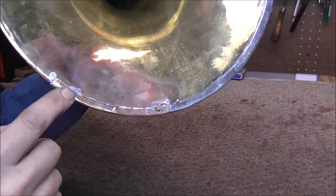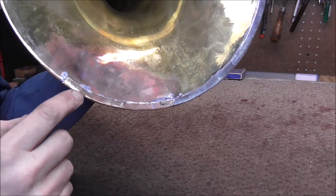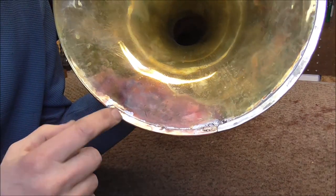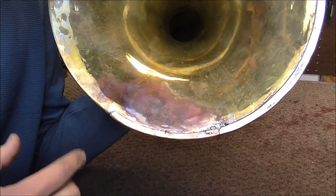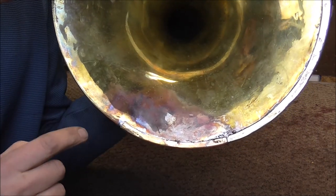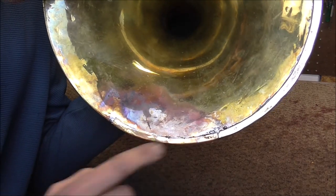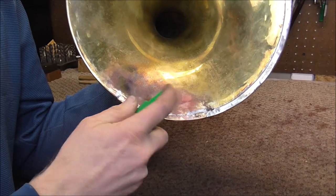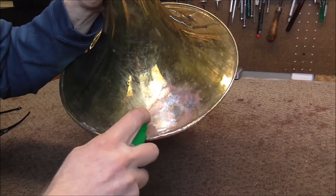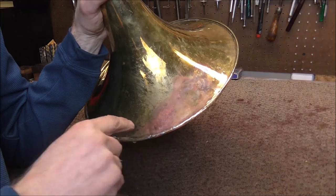There's a big clump there. The way I do that is I'm going to heat it up until I see it melt, and as soon as I see it melt I'm going to take the flame off and wipe it with a rag to clean it up. Then it's going to have an extremely thin layer of solder. I have to be very careful because if I heat up the ends too much, those might spring loose — if I were to heat the whole thing up to temperature at the same time, it would just fall off and I would have to start over again. So I'm going to heat up one spot, clean it up, wait for it to cool off, then move on to another spot. I also need to neutralize the flux — I have a spray bottle with ammonia mixed with water, and that neutralizes the flux so that it stops acting. Because if the flux stays on there when I heat it up, the solder is just going to move around and stick to everything. But if I take the flux off, the solder will come off easier.